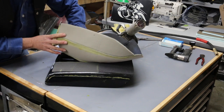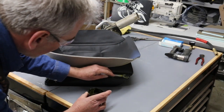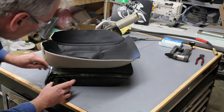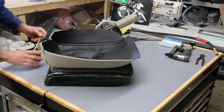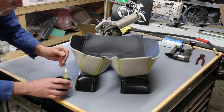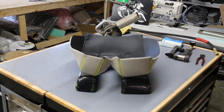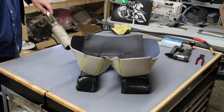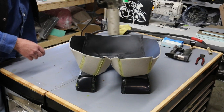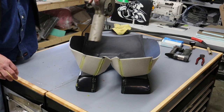It lays right into place just like so. Next step we need to glue this seam — I've already glued it on the other side. I moved all my glue away because I don't want it to spark, but I'm going to start by heating up a little bit. I'm just running it pretty quick. If you're using a heat gun, keep it moving — don't direct it on one spot for very long because you could easily melt the material.